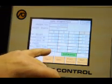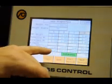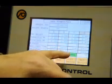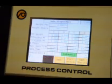And you can see the last millisecond time that last ingredient fired down here. So A just fired a 290, then B fired a 245, and now C is currently firing. And you can see it's working down to about 4 to 5 different hits for that minor ingredient. So you can actually watch the operation, look at remaining weight as it's dispensing, looking at how many shots it takes. The fewer shots, the better the throughput on your blender. Okay, we'll go on back.